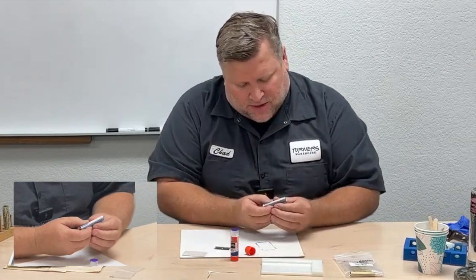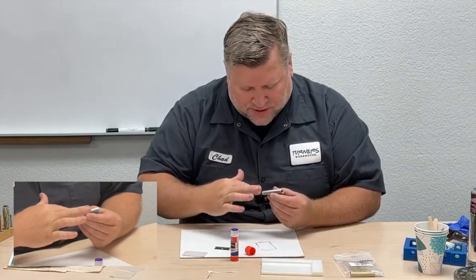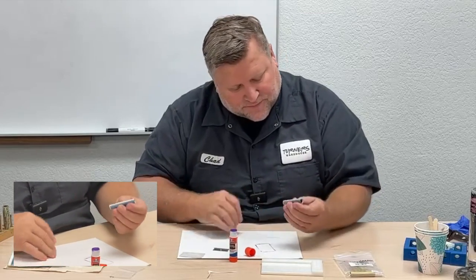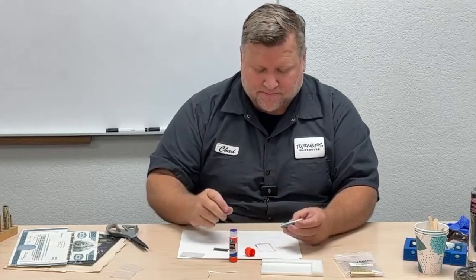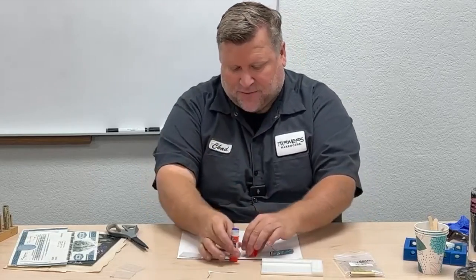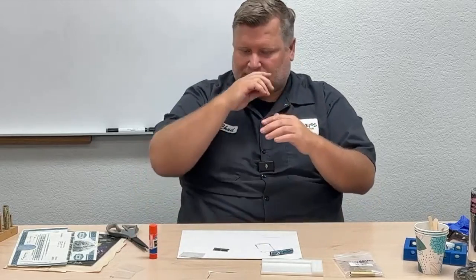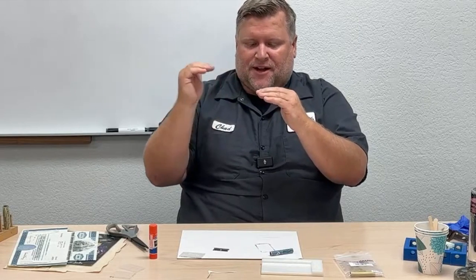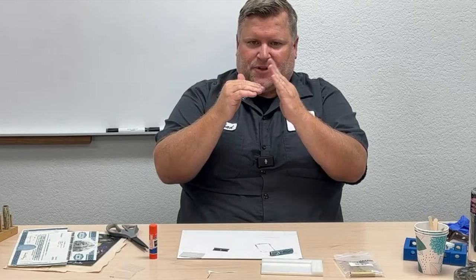And what you may or may not be able to see is there's a purple line right where the paper overlaps. So you want to make sure that's nice and smooth. Again, I'll push it out. And it's the really thinnest purple line right on the seam. And I do that with every cast like this because it seals, at least I think it seals where those papers overlap. And I don't have resin getting in there, because I think if resin gets under that lip, that's when you get the lift.